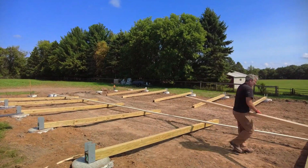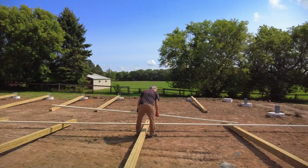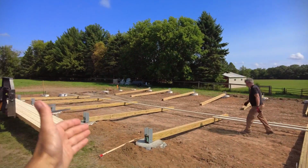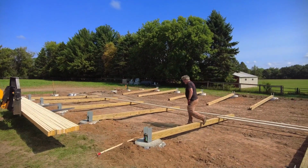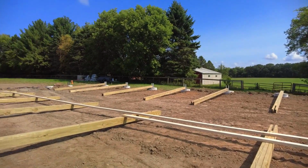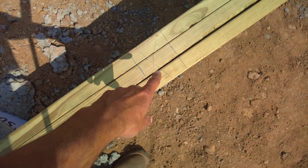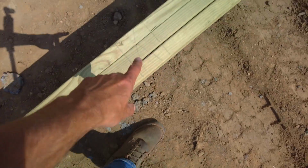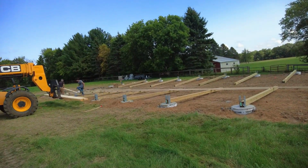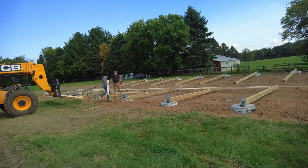So we're going to start laying all the girts on. This wall is going to go up in 2 sections. We'll have this section come up, and then we'll have this section over here come to meet it. So we're picking the wall in 2 different picks. Last week, Donovan, when he set up all these posts, did all the layout work on them. So similar to framing a wall, these are the locations of all of the girts on the walls. With the spacing correct, we can go ahead and start laying those girts in place and start actually nailing them